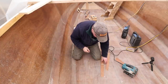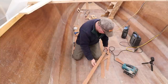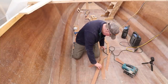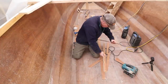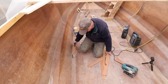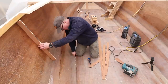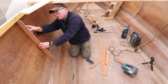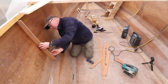I've pulled apart my previous template that I used on bulkhead seven up forward, and I'll just reuse these bits. I've trimmed one and need one that's a little bit smaller. I have it up to the bottom of the stringer — it doesn't have to be right to the chine, just approximate. It's looking pretty good; I just need to take off a few high points.